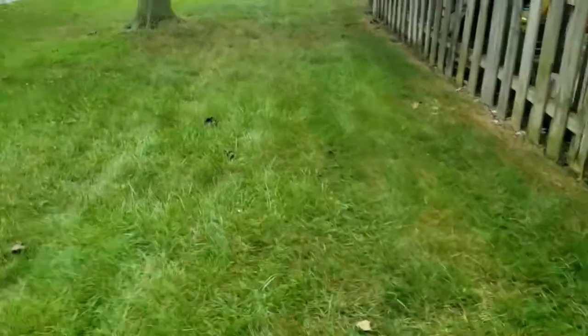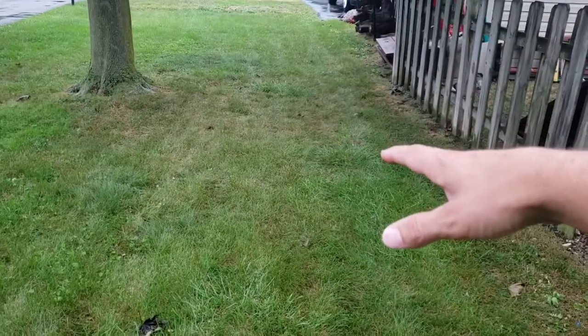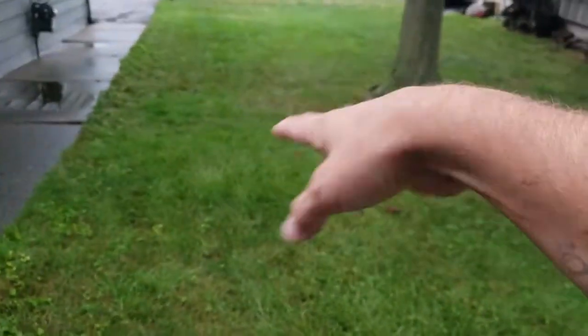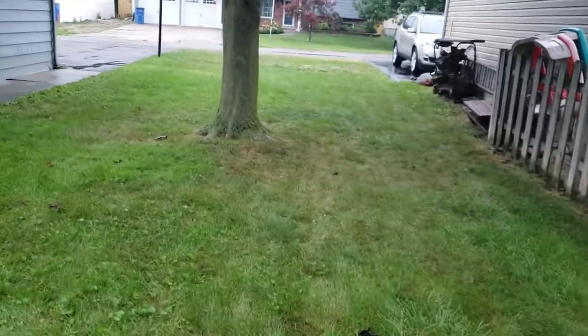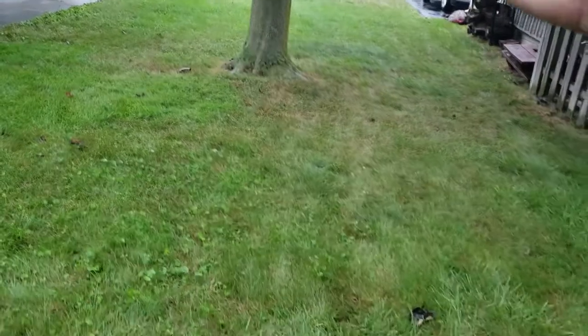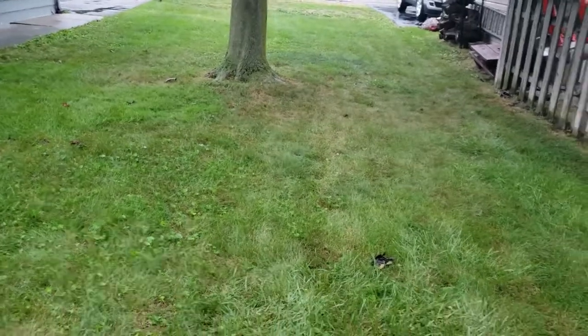Run it this way, unless it's easier to trench next to it and run a separate trench — I don't think it would be, though. It's going to pop up in this direction somewhere over here. The downspout is going to pop up anywhere over here. But the French drain is going to empty into a dry well, and I'm assuming you're going to want to stay away from that tree. So pick a place for the dry well. The top of the dry well will have French drain pipe in the top port with a pop-up on top. So you're going to have three separate pop-ups — pretty much one main trench with a trench connecting over there, and a completely separate pop-up here.